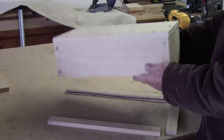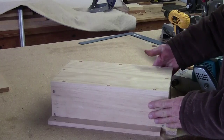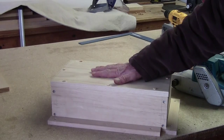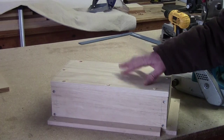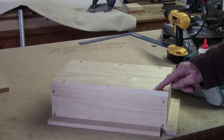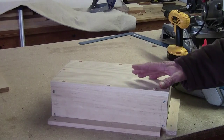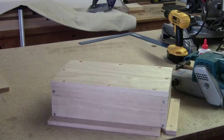Got myself set up. I built the frame around here because I'm going to be belt sanding this - it sets in there so it doesn't move. It costs money to buy clamps to hold this down, so I came up with this idea - it's cheaper. From here I'm using a 120 grit on the belt sander and I'm going to take down these plugs. The glue is still not dry yet, which is good. Any sawdust will go down in any crack and fill it up.